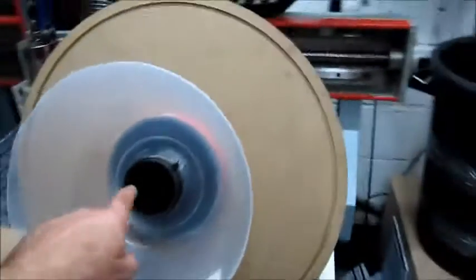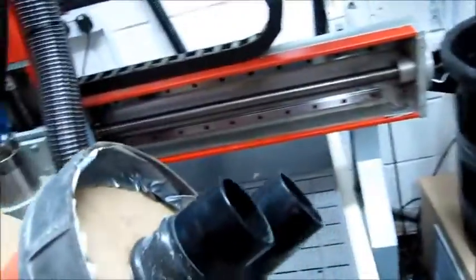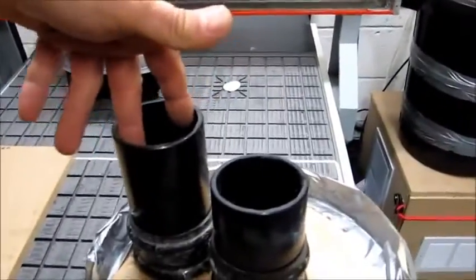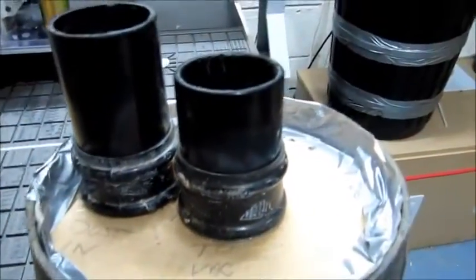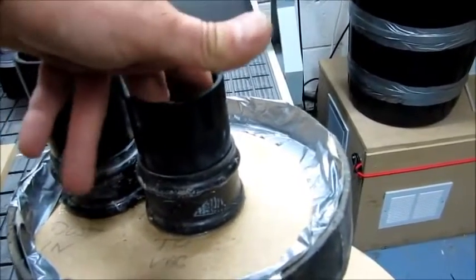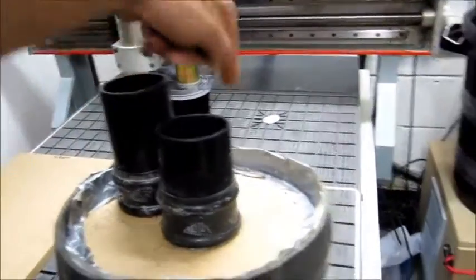Then the actual vacuum is being sucked up here and up to the top. The way that the gadget is actually working, the dust is coming in this tube, and when this tube goes into the top of the cone, at the bottom here, which you can't see, is a 45-degree bend pointing in one direction. So what you're trying to make happen is as the fresh air is being extracted through this hole, which is from the centre of the pudding basin, you're trying to make the contaminated air, if we call it that, swirling around